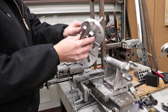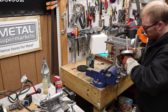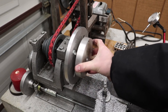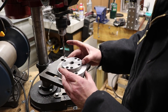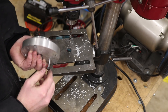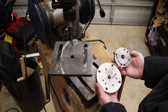I used super glue to attach this part to the turning arbor, and now that I'm done with the operations I needed, I use my little propane torch to heat up the part and arbor until the super glue breaks down and I can wiggle it loose. The turning operation left a little ridge around the inside of the part due to the radius of my tool, and I knocked that down with a scraper. I tested the fit on the face plate, then used the off-the-shelf chuck adapter plate to locate the holes in the temporary chuck adapter plate, ensuring the spacing is right — since I don't have an indexer to make 120-degree spaced holes.